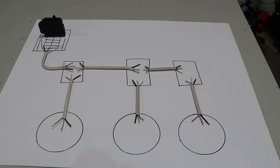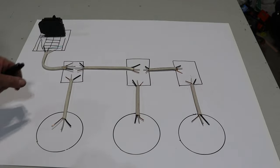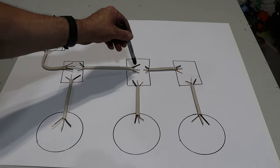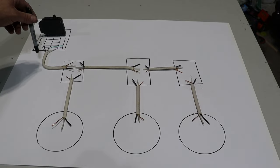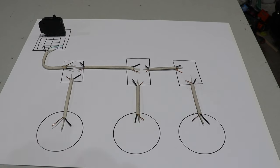So the setup I have in my garage is a lot more complicated because I put a lot of the lights on one circuit. Essentially I have my Romex coming from the panel box over to my first outlet box, which is the square box — this is where I'll install a switch. The switch will control this light here, but I'm also going to be powering these other switches and lights from this same breaker in the panel box. All you're going to do is make some connections here in the box and hook up your lights. One of the reasons I wanted to do this video is to help you understand how electricity works so you can understand how to make things work yourself for your particular situation.